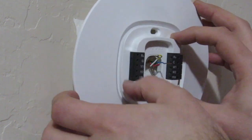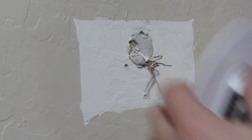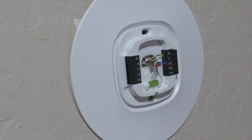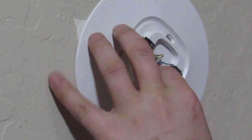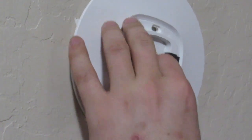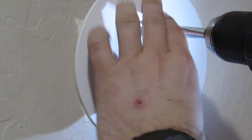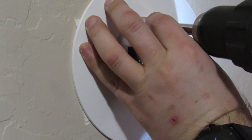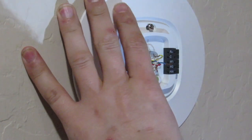Then we put the thermostat mounting bracket over it. It snaps to the larger frame itself and holds it together. The screws that we put in the wall will permanently hold those two pieces together as one. Once we get all the wires through, let it hang there for a second, then get the power drill and the screws that came with the Ecobee 3 Lite. Start by putting in the top screw loosely — if there's a previous hole in an appropriate spot you can feed it through that, or start a new spot to help hide any paint discoloration. The thermostat mounting bracket has a nice little bubble level at the bottom already built in.